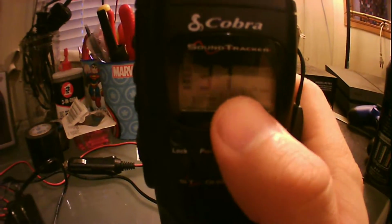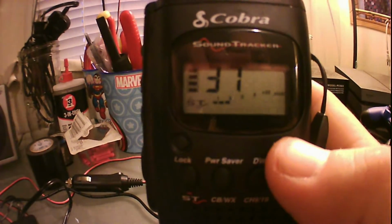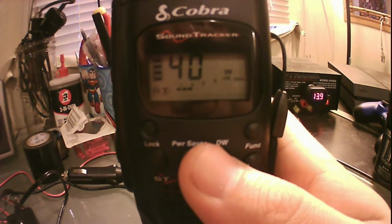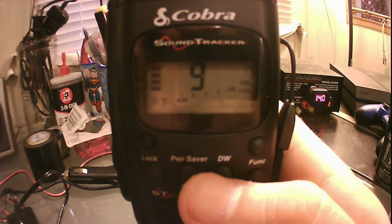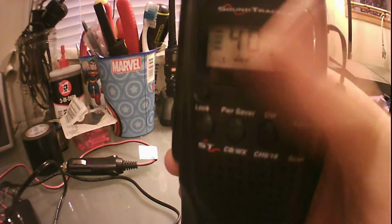Well, hang on, before we do that, first thing you've got to do is set it on the first channel you want to monitor. So in this case, let's just say we're going to do channel 37, I believe that is, yeah, and 40. Alright, you press function, press and hold this until it beeps, and then we'll go up to channel 40, press and hold this, and now you can see it's going back and forth between 37 and 40. And what's it say there? Emergency. There we go. So now we're back out of it, and it's just monitoring channel 40.